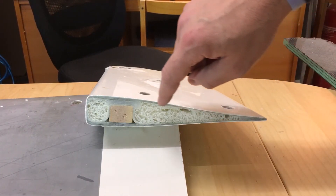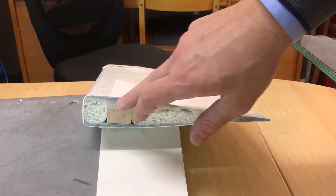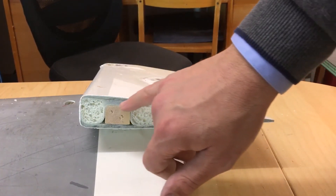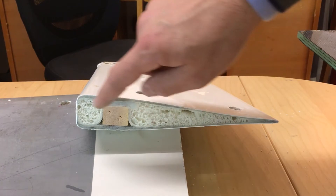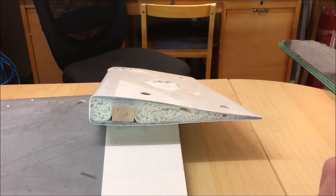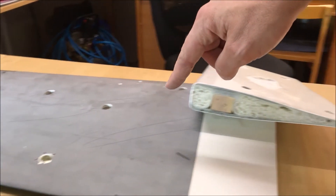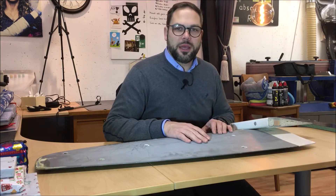As you can see, the rudder construction is quite interesting. There is a glass fiber laminate layer — first the gel coat, then the glass fiber laminate itself. Inside there is another glass fiber laminate pocket which is filled with epoxy foam, and inside there is a block of epoxy foam laminated along the whole length of the rudder, giving additional stability to the whole structure.